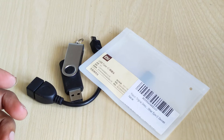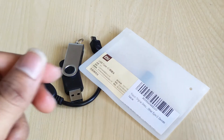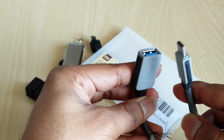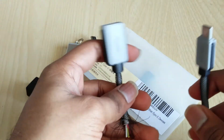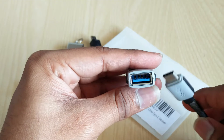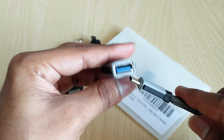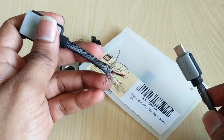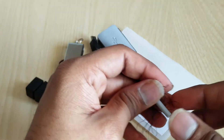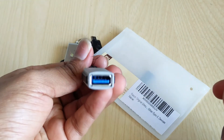The cables available in the market are actually USB version 3. This is one of the cables I bought from eBay — it didn't work and the pins were broken, so I ripped it apart. You can see it has USB-C on one end and claims to be USB 3, but if you rip it apart you can see there are only four wires, so this is actually not USB 3 either. This doesn't work with your OnePlus 2 phone.